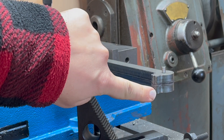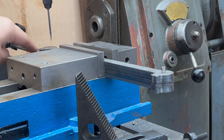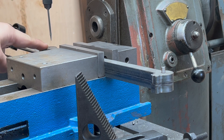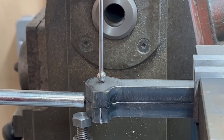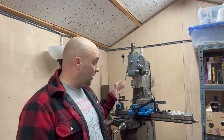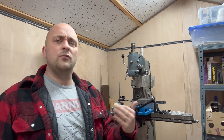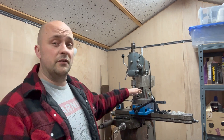There's another hole on this side here, and now on this side — there's a little hole there. I can just use that as a drilling guide and drill straight through that hole into the other side of the coupling rod. I now have this setup where I can drill straight through this coupling rod, and I'll probably do it at one-eighth of an inch. The instructions to this build series suggest drilling to one-eighth and then pinning them together as a way to machine the outside faces of the rods.